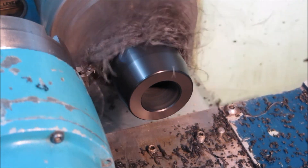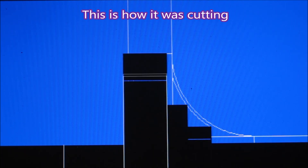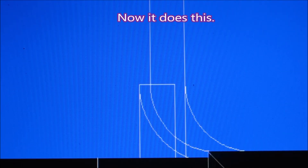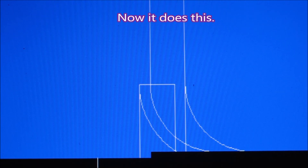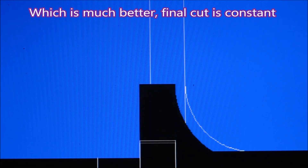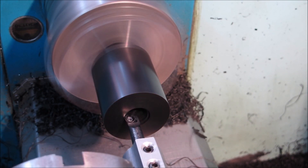Plastics love making this mess, don't they! This is how it was cutting - just in three groove-type steps and then going around the radius. Then you'll see what I ended up doing to get a better result. That's just the parting tool and the turning tool getting out of the way. You see the parting tool goes in and then actually goes around a radius - we cut a radius there, then we cut another radius for the finish of the radius, and that gave me a much better result.